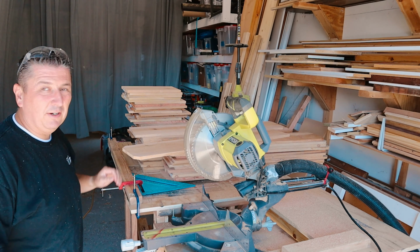So what I did was I took 16 1/4 inches off of each fence picket, the ones I was using for 5 feet, and that's what I'm using for the ends. And then the length of my planter box is basically whatever I have left over. So if you use 5/8 inch fence pickets that are 7.5 inches wide, chances are you're going to be right around 16 1/4 inches on your end pieces. And I'm going to continue building this so you have a better understanding of how I'm putting this together.